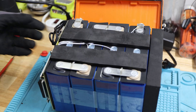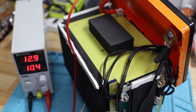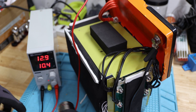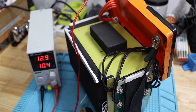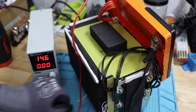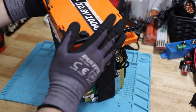Let's quickly test if the high temp cutoff works. The bench power supply is connected to the terminals and the probe is down near the temperature switch. I'll use the heat gun and see — here's the display, you can see it's charging. Turning on the heat gun — and there we have it, it stopped. And there it's back up. The high temp cutoff works. There's no cold cutoff, which would be great to see, but it is what it is.